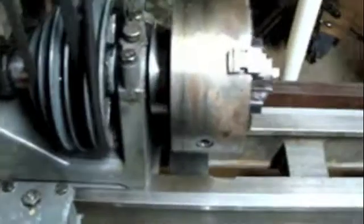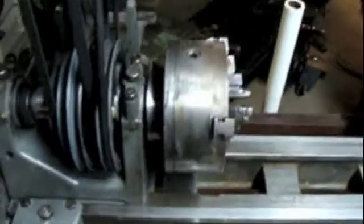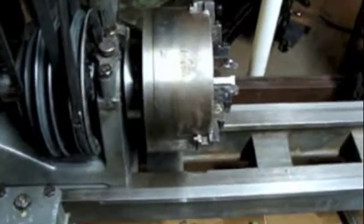So now, when I turn this, you can see that seems to actually be working, doing something. Now I want to see what happens when I engage this compound drive. So let's see if anything changes. Nothing's happening, because what wants to happen right now is if this belt wasn't slipping so badly, this belt would be driving this pulley.